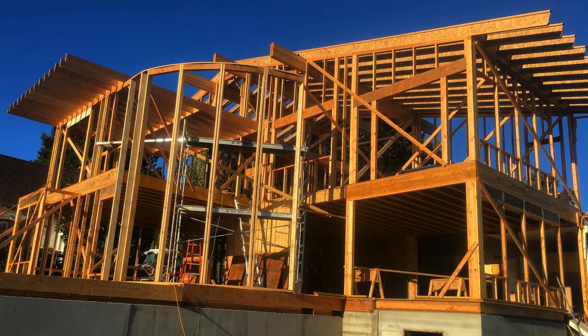Making some progress on the framing — all of this framing was done to consider the incorporation of hempcrete around it. You'll notice there is no shear panel on the exterior of this building. Where you will see shear panel, OSB, is generally on the inside — some interior shear walls on the first story. That's because hempcrete wall assemblies are vapor-open; they need to be able to pass vapor through them. OSB and plywood generally interfere with that process, so shear walls and structural engineering of a hempcrete building are a challenge in their own right.